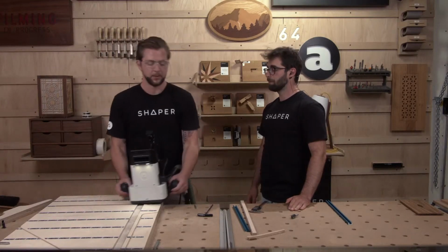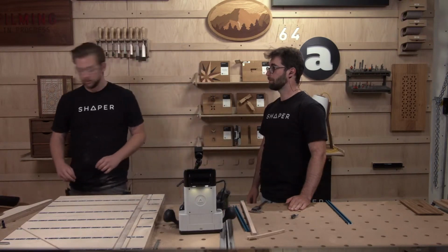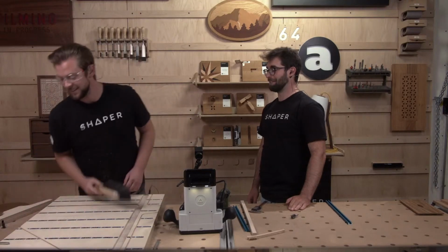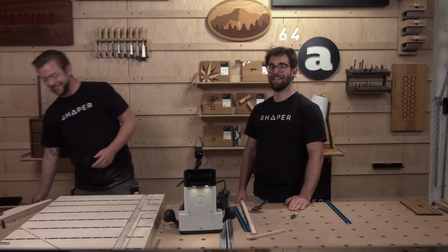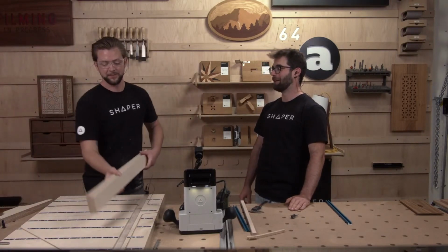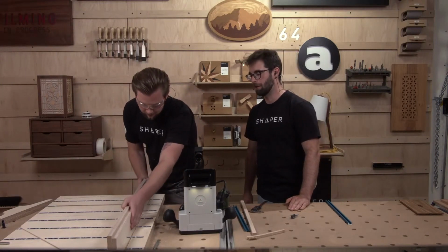You know what I'd like to do is I'm still using that 3/4 inch cutter, but I just took 5/1000ths of an inch off. It's not very much proportionately. It feels like less with a 3/4 of an inch cutter than it would with an 1/8 inch or a 1/16 inch cutter. It feels like more with a smaller cutter.